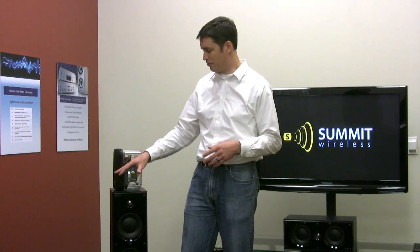Current wireless solutions in the market are viewed as interesting toys, but nothing that could ever produce a high-quality audiophile-level sound. That changes now. Summit Wireless sends the pure digital signal from the source to the speaker, up to 24-bit resolution and 96 kHz sampling rate. The exact same data that was used in the recording studio gets directly to your speaker. Once the data is inside the speaker, we use high-quality digital filters to replace the old analog crossovers. These digital filters give the speaker designer a much greater palette of tools to work with, without the limitations and distortions of old analog components. Also, as the amplifier is inside the speaker, the speaker designer can now design the whole speaker from the amplifier all the way to the speaker cone.